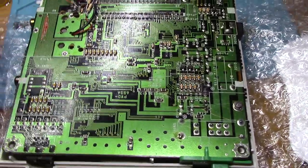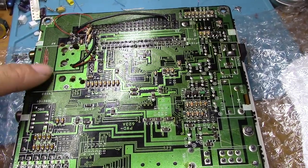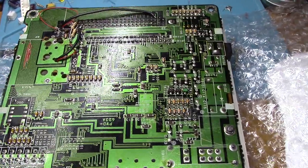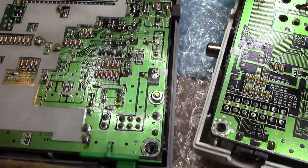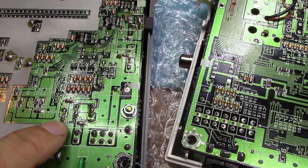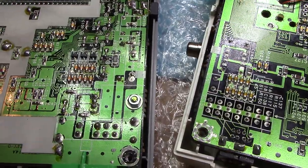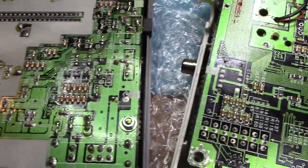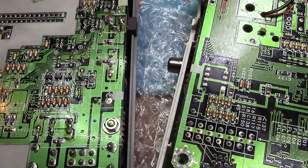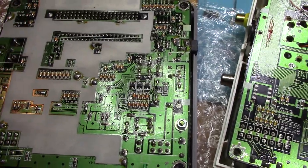This unit, as I posted in another video, is already just really hacked. These data lines had to be patched over here, some other minor issues, but it's working good. This one's been recapped by the way, and it's been recapped with a lot of ceramic capacitors, which is why these blobs are all over here — these are all 0603, 0.1 or 1 microfarad capacitors. In 30 years or whatever it's been, you can get smaller sizes for things that'll last longer.